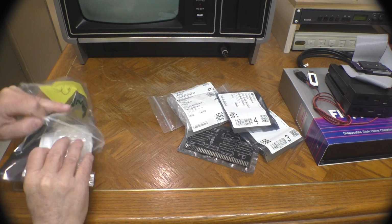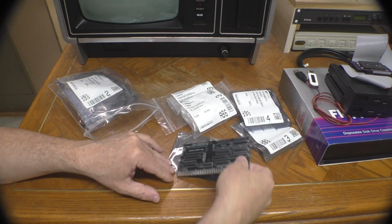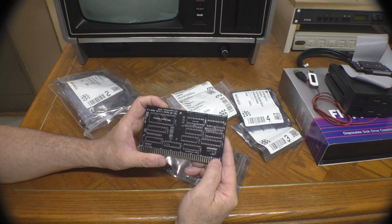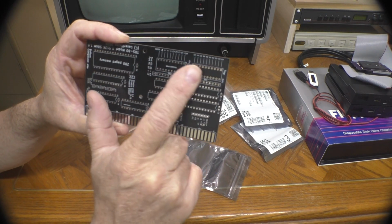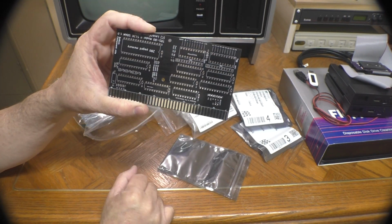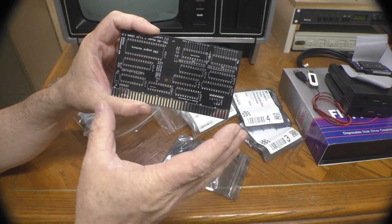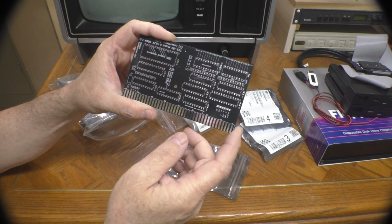Well, I just can't get anything put away today. You guys probably don't care about watching me do that anyhow. But he did a nice layout on the board. He's got a couple LED arrays just here, with like 10 LEDs, so you can check the status of things, or you can adjust the GAL and PAL to be able to show you certain things as you're developing.